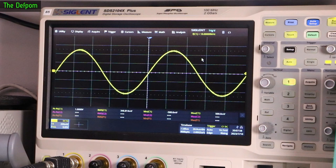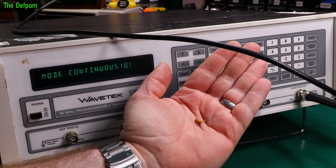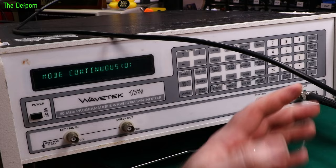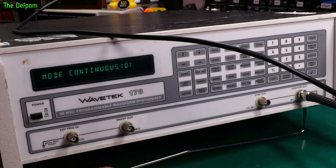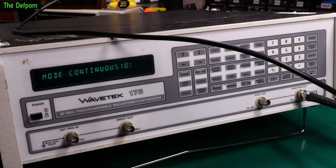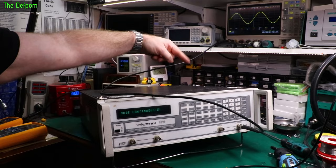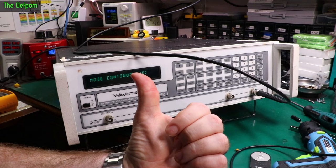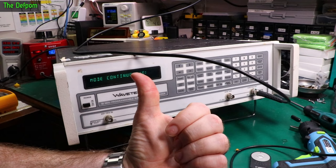It's always a capacitor. This one little tantalum capacitor took down this entire piece of equipment — evil tantalum. Usually tantalums aren't such a big deal. They do go from time to time, usually when they get older and when they've had issues with ripple — high ripple power supplies are when tantalums will fail. It's usually electrolytics that go more commonly. Anyway, I think I'm going to call this thing fixed. I'll play with it some more to make sure it functions properly. I'm going to sell this thing — I don't actually have a use for it as I already have a signal generator that can do more. Subscribe if you haven't, and there's a Patreon support link if you want to help me buy test gear. Catch you later.